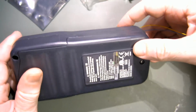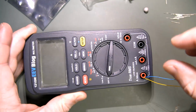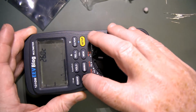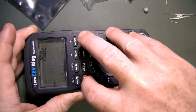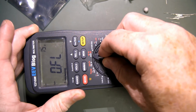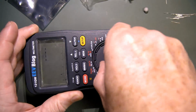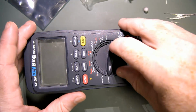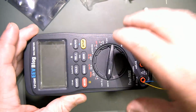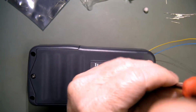All right, we've got the serial number 133. It's now done approximately 25,000 cycles with the new shim, and the contact resistance is still okay, but I would deem it to be failed now, because if we go into the diode test mode, the knob has the problem. Yeah, there we go. So we've got that dicky contact again. But that's our jig failed actually at 25,000 cycles. We had a problem with the drive motor and everything else. So I'm not sure if that's put any extra force on the switch or whatnot. But that's what we've done now. 25,000 cycles. So let's have a look.